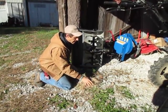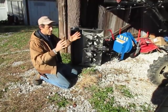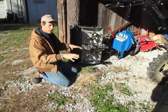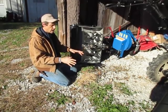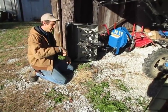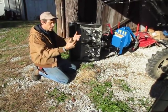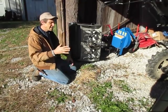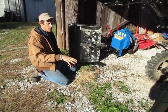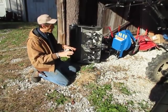When you encounter something like this with a Power Harrow — that is, you've taken your bed, flail mowed your cover crop, and now want to punch that into the top layer of soil to help it decompose — the Power Harrow is not too good at that at all, because it mixes horizontally. It does not invert soil vertically. If you go deep enough with the Power Harrow, like four or five inches deep, it'll sort of bury some of that material.